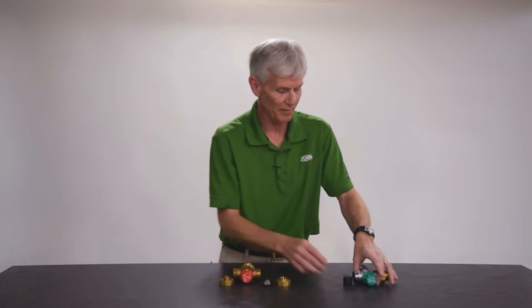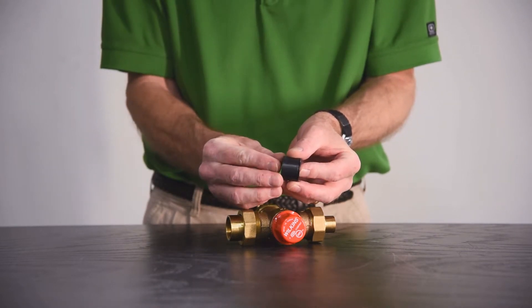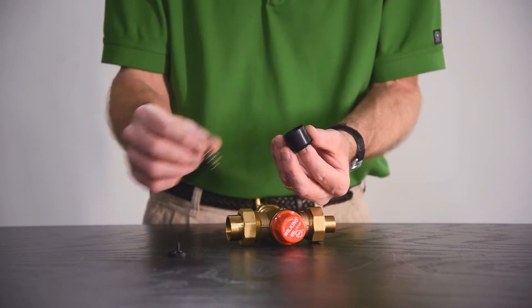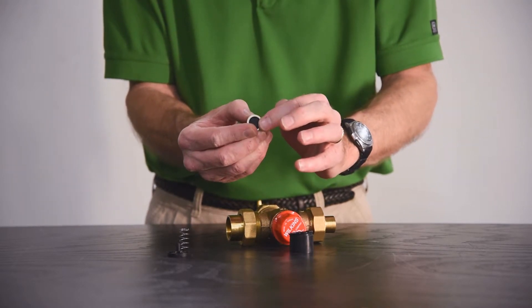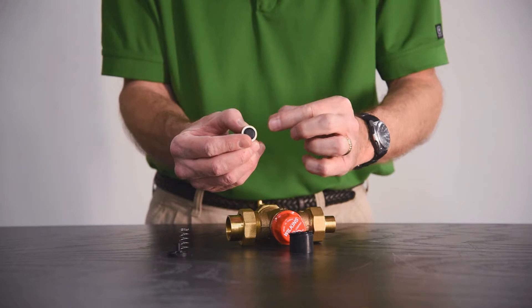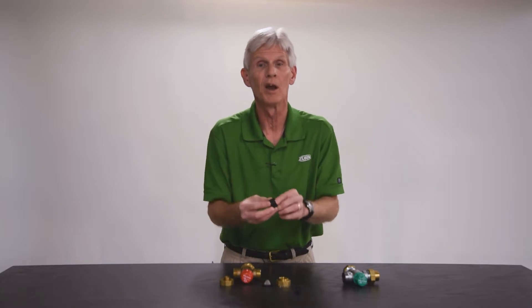What I've got here is another TMV where I've pulled the check valve out of it — just a very small little check valve, and these are repairable. We'll give it a little push and the back will come off of it. The spring will come out and ultimately that exposes the little poppet. We can change this rubber seal, or if it's just a little chip of debris on there, we can thoroughly clean it. Once we get that cleaned and put back into the TMV, that will stop the cross connection between the hot and the cold. In the event that this check valve has become damaged — the debris has harmed the seat inside or scarred the poppet such that it can't rebuild — this is a user replaceable component.